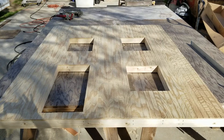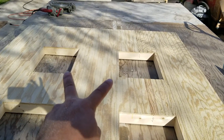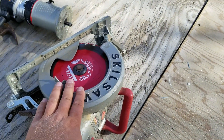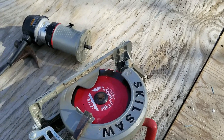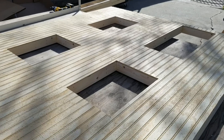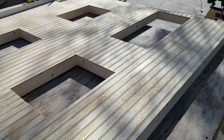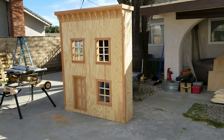I've got my numbers right and the overlapping edges should look good. The frame is all skinned with plywood, the openings are all cut out — you can see the door, the first level window, and then two upper level windows. I cut out the majority with a jigsaw, left about a quarter-inch edge, then took the flush trim router and zipped it around to clean it all up. Now we'll put this together and add trim — trim out the inside and outside of the windows, do some trim on the outside corners, and add some corbels up at the top.